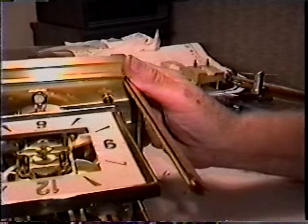Now you can say, how am I going to get this spring out of here? I look under here, there's a cylinder thing here. Well, that's where your balance nut comes in, balance wrench. It has two cutouts in the cylinder of the nut. And the tool that I made up is just a round cylinder with a pin in the center. So I can put it inside that channel and I can turn this off. And then I can turn the screw off. Take the screw off, take the balance off, and now we have